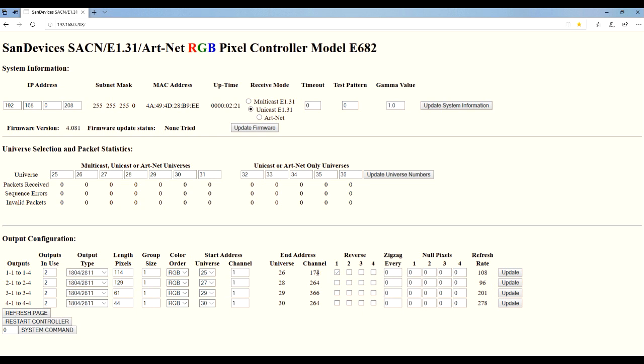That's why on the two that I started out with, I did not put the peaks together, peak 1 and peak 2. Even though the peak 1 is less, I could have put the peak 2 first and then try to reverse the second one. Problem is, the channel count goes all the way out to 174. And you reverse it, that means it's starting on an imaginary number out there, 15, 20 pixels out, and then comes back, so you have a bunch of pixels at the end of your string that don't light. That's why I can't do it there.